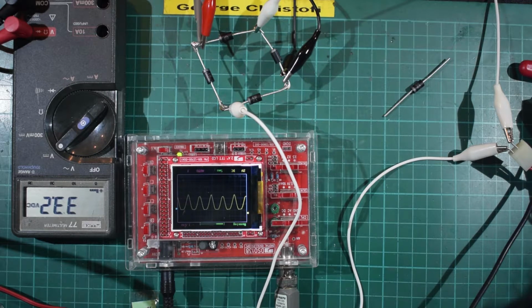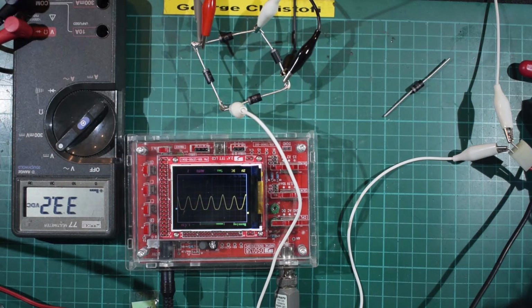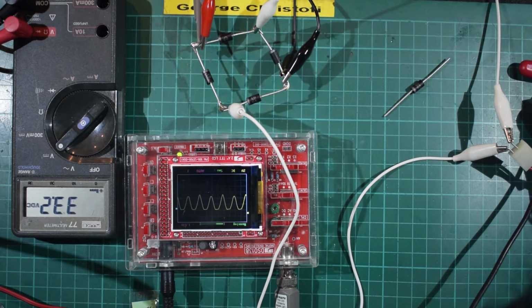So you're doubling the frequency because of the way you're rectifying the AC voltage and turning it into DC. Because you're taking all of the negative and making it positive, it's actually called full wave rectification. And as I say, you'll see it listed on circuit diagrams as such. There are benefits and disadvantages to both, and I could go into them, but to be quite honest, this is a basic what do diodes do and a simple look at rectification. If I started to go into what's more efficient and how much current do you get and how much voltage, I could baffle you with maths.